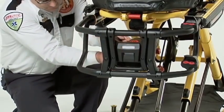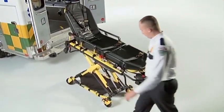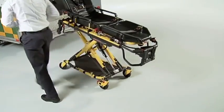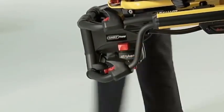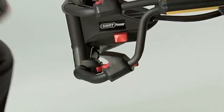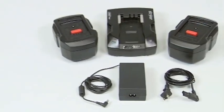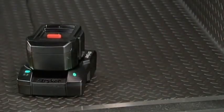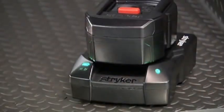Never attempt to remove a SmartPak when the cot is activated and the motor is running. SmartPak removal is fast and easy: reach under the SmartPak — your index finger will fall on the red release button — and press the red button as you remove the SmartPak from its slot. Alternatively, push the red release button along the right-hand side of the foot-end control enclosure and slide the battery out. The SmartPower system comes with two SmartPaks, a SmartCharger, and a power cord. Once both packs are fully charged, insert one into the PowerPro cot and keep the other SmartPak in the charger.